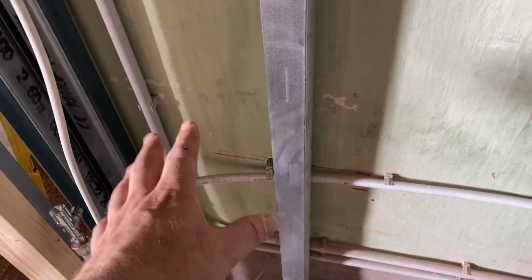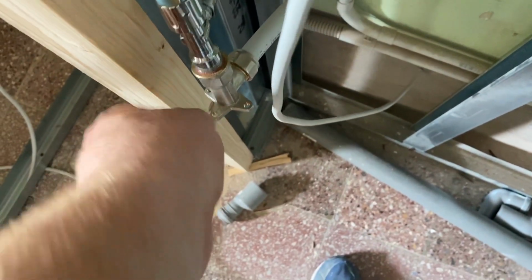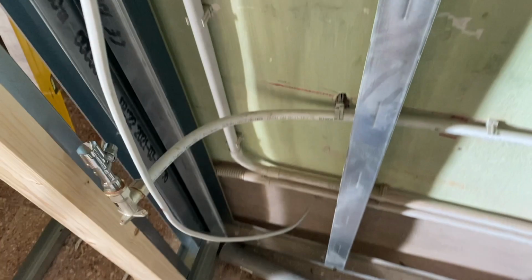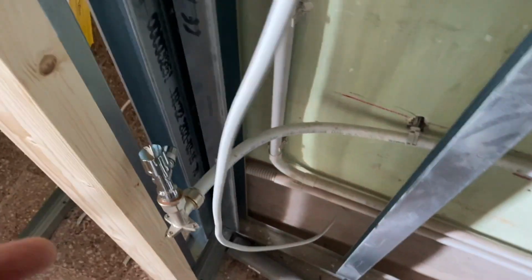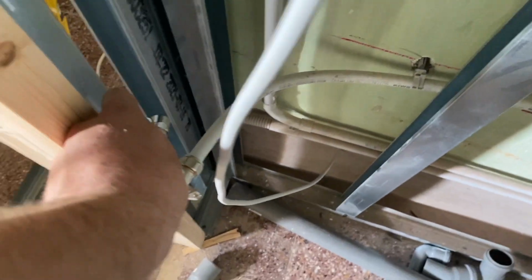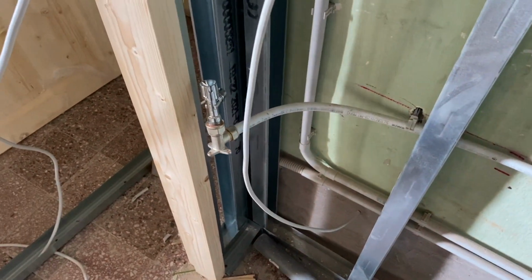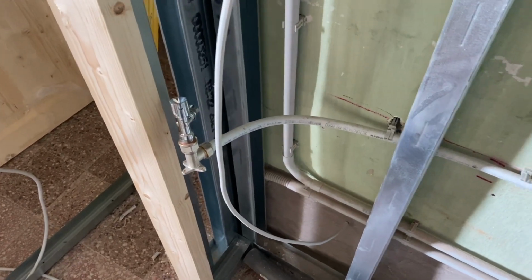What we need then is to run the wastewater from the sink and get this tap set up, because we'll always have this screwed to something, and then this tap will come out of the wall, and there's a pipe that goes from there actually to the tap on the little sink, so that if the tap does ever start leaking or you need to change a washer or something, you just have to turn off this little tap here rather than cutting off the whole water system. It's the way it's always been done in Germany and in Austria, so that's how we're doing it here.